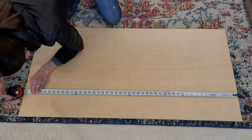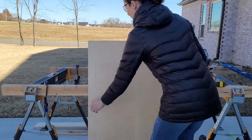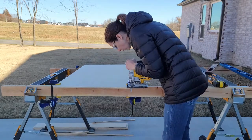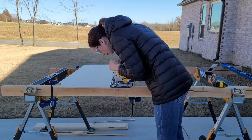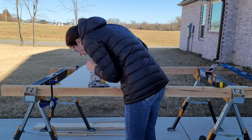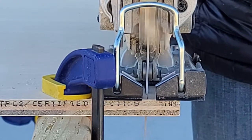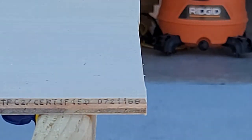For each shelf I'm marking the 18-inch depth — it's a little bit over 47 inches wide — so that when I scribe the other side I don't take off too much. I used clamps with my sawhorses setup and my DeWalt jigsaw. Because the wall literally curves, the jigsaw lets me make that intricate cut to follow the natural wall. I didn't want a big gap and I didn't want to fill it with caulk, so the jigsaw was the right saw for this particular job.